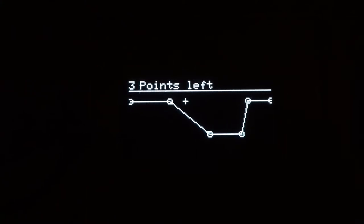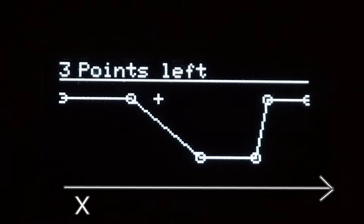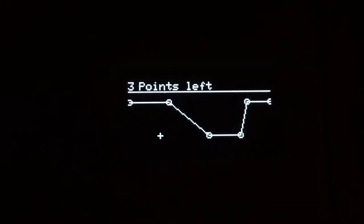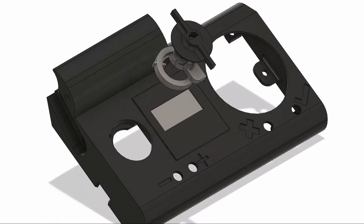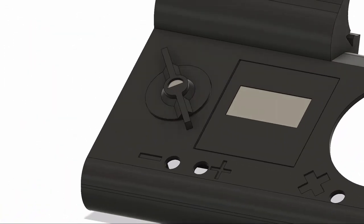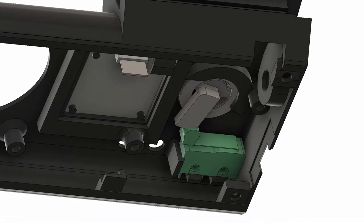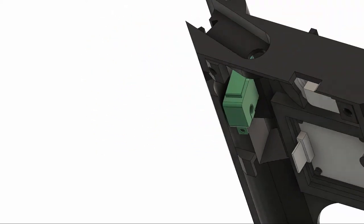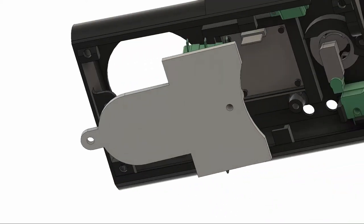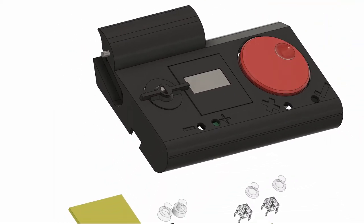What do these points actually mean? The x-axis represents the position of the slider in space, and the y-axis represents speed. So a straight line like this would mean that the slider is going to move at a constant speed. Slope down would mean that it would slow down. Slope up would be speeding up, etc. The idea was that you would draw the movements first, then set a time for the entire sequence — anywhere from 3 seconds to 24 hours — then just start it and it goes. This was meant primarily for timelapses, or for me personally, because I usually film alone and sometimes I need the slider to move at different speeds. I never managed to actually make it work, but I will try in my free time. If any of you want to try it as well, I will upload this version of the software with some notes. Let me know in the comments whether I should start uploading to GitHub.